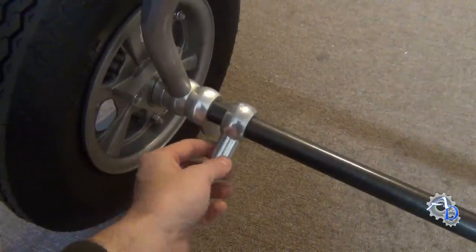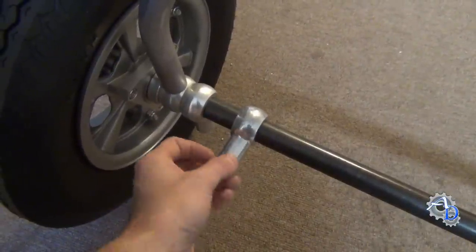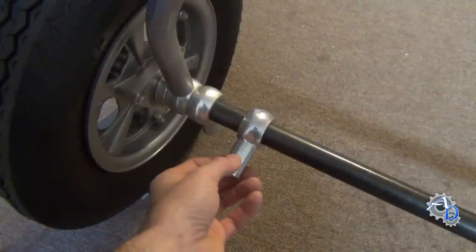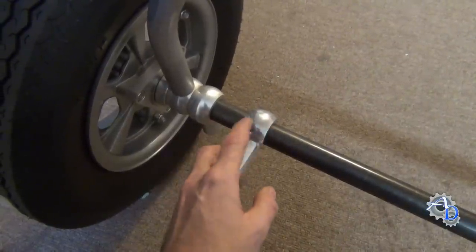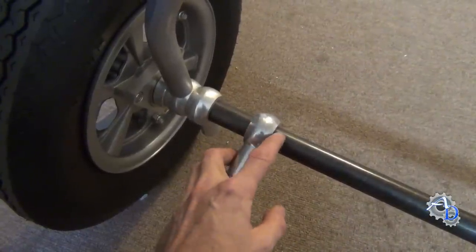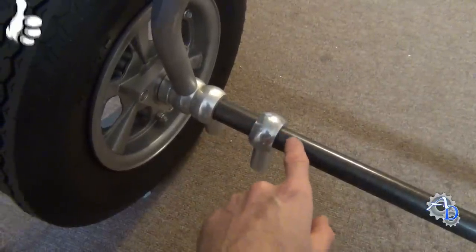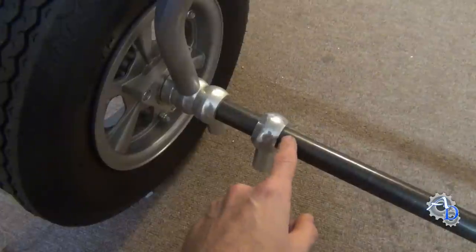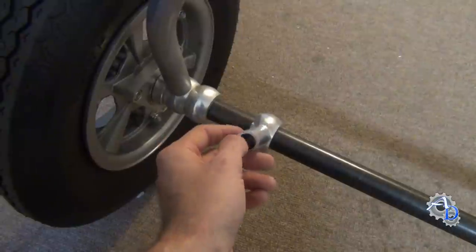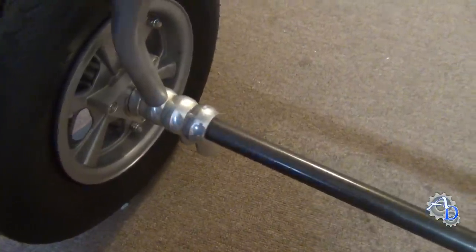You'll notice how the profile at the bottom there is convex. What I did is I took a solid piece of aluminum, put it in a lathe, and turned a 1.75-inch diameter ball on the end. Then I milled each end down to a 1-inch width and bored a hole through the center with a couple thousandths clearance so it would fit on the tube. Then drilled and reamed out the other end for lightness. So that's what I built the ball-making fixture for.